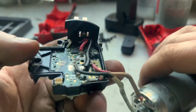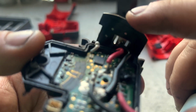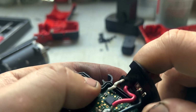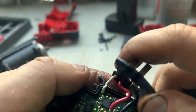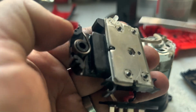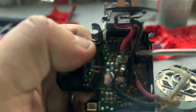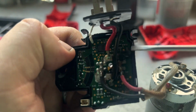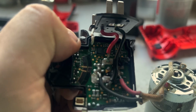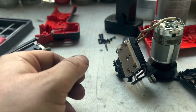Don't see anything there. And I don't see anything there other than that wire that is clearly been put the wrong way. Yep. So I can still feel all the radiant heat coming off of this, so we're just gonna avoid touching that. But it doesn't look like the board is burnt at all. What I'm thinking though is that something on the backside is burnt. Something like a capacitor or something on the backside has exploded. So that's pretty much junk.